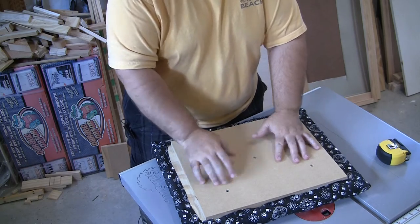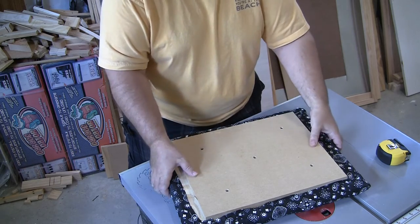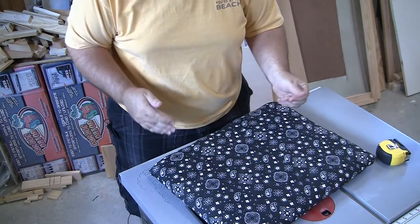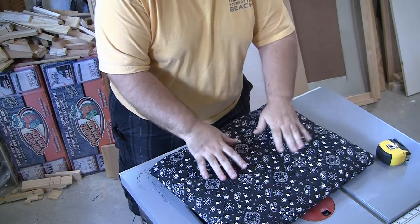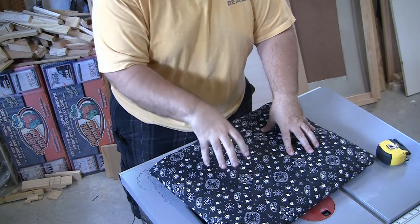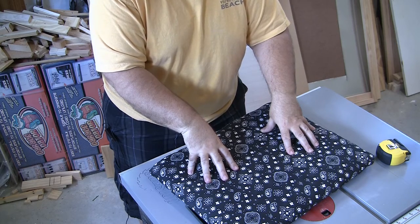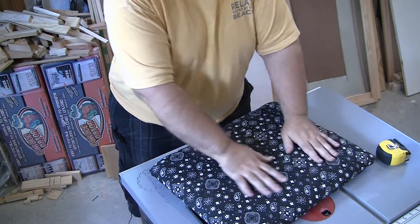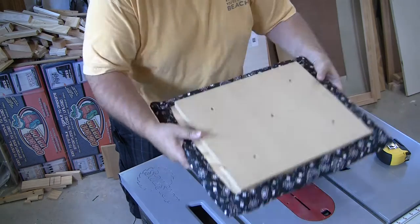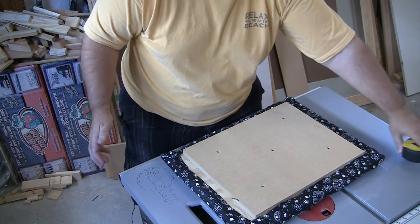You cut that out, you glue this down. I put a few screws into it to hold it while the glue dries — put it right in the center. From there, simple as it can be. I went and bought some foam padding from Walmart. Used spray adhesive, sprayed it to the top of the seat. I first made sure to test the adhesive to make sure it wouldn't melt the foam, then glued it to the top of the seat. Got fabric, got the piece of material centered over it, turn it over, wrap it around tight, staple it down. There you go — you've got yourself a perfect little seat.